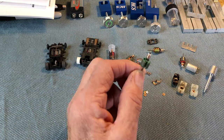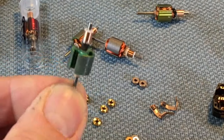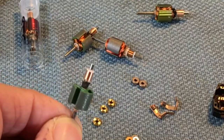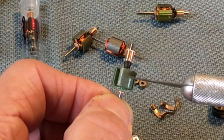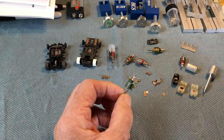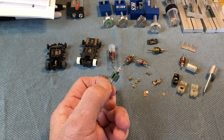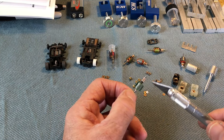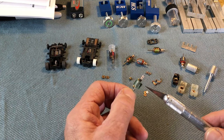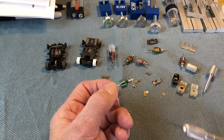This is what an armature blank looks like before you put the wire on it. Armatures are made up of laminations — this particular one is a 21-lamination blank, meaning there are 21 little pieces of stamped-out steel stacked up, then powder-coated. You might ask why not use one piece of machined steel — it simply wouldn't make a good armature. When they punch these pieces out they're coated with a thin layer that insulates them electrically so they don't short out, then the whole blank is powder-coated for further insulation.